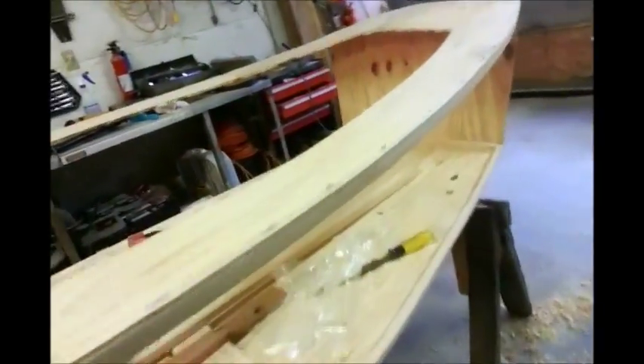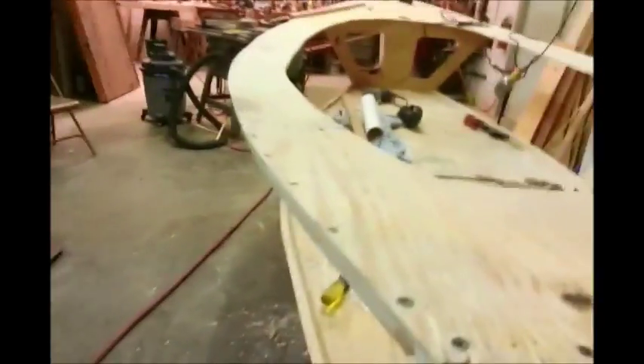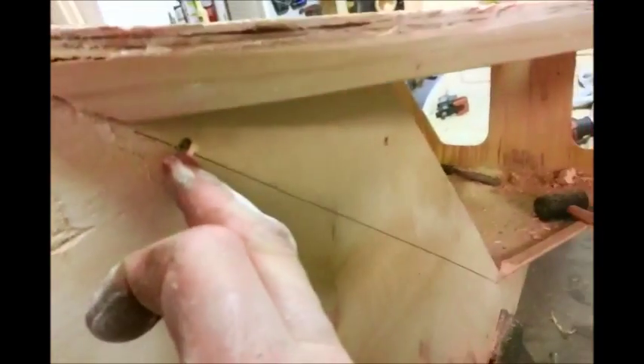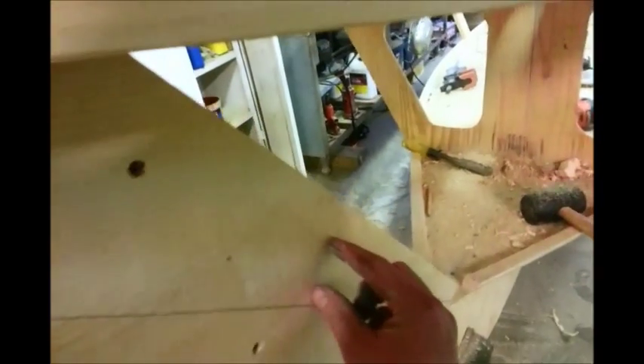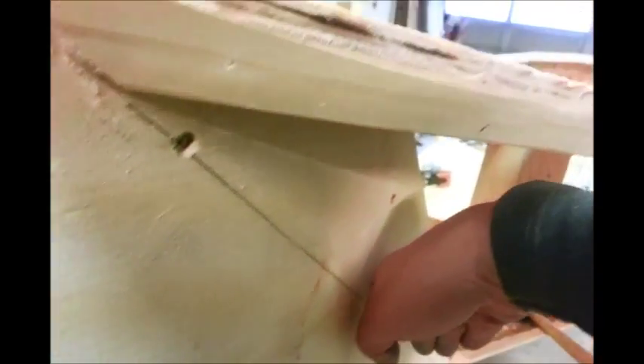You can see down here at the bottom how it's not real tight — actually it just wasn't holding the stick well. It's a little bit more open at the top, but that's not a big deal, that's pretty close. We're not going to worry about it. We've been going through and making sure all of those are true, getting the corners nice and flush with the transom. Next, where this line is, that's going to be the front of another stringer we're going to put in that will lay right in here. It'll come out at an angle and give us a spot to screw the front of our side panel on when that comes in.